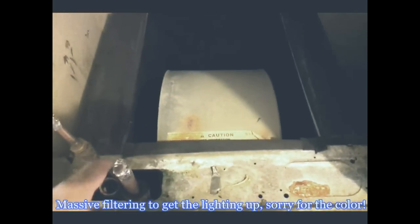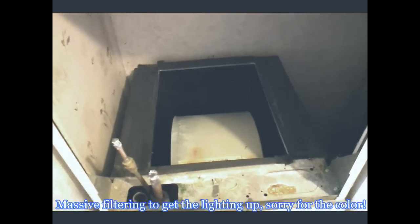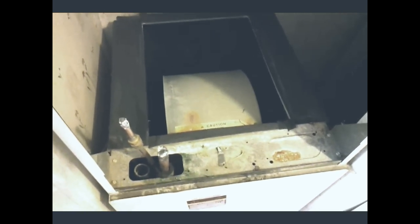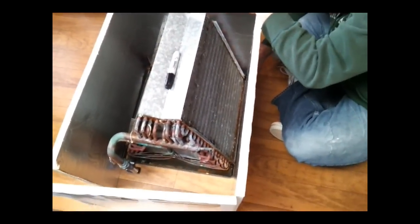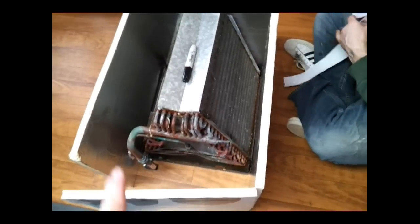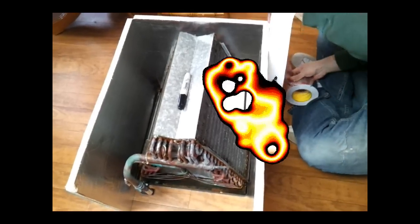I've filled in the corners where we had foam gaps — where they just laid down a couple of pieces and it was sucking air underneath the coil down into the unit. So this time when we go back, we'll have all of the base sealed up. We're doing a test setup here, and we're going to fit it as tight as we can and then seal it to the bottom, and try to lift the whole thing in in one shot and have it sealed up.